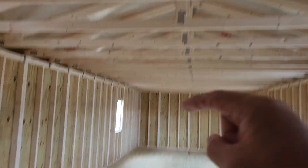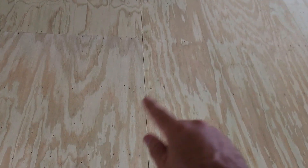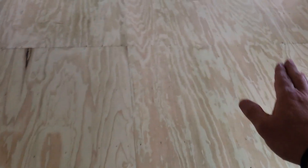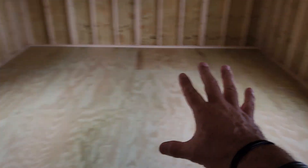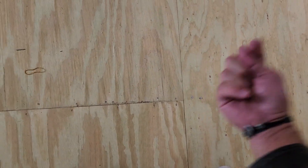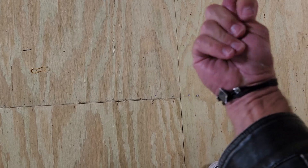The five-eighths inch plywood floors are fitted together using tongue and groove. That's important because some other companies don't use tongue and groove to put their plywood slabs together. With tongue and groove, each plywood slab is interlocked with every other slab, making it one giant solid, gapless, seamless floor. Bugs underneath the building cannot get up into the building because of that interlocked tongue and groove design.